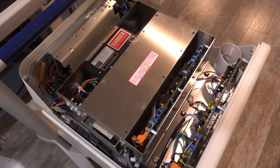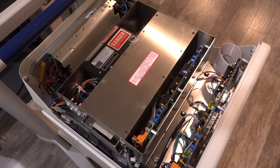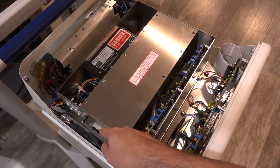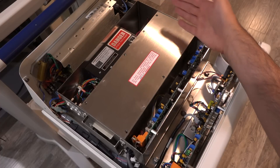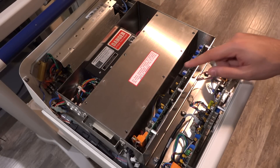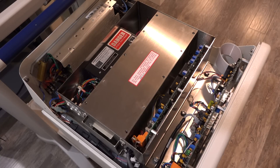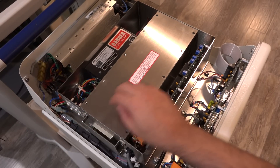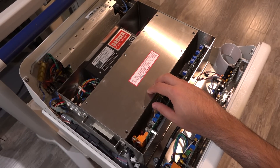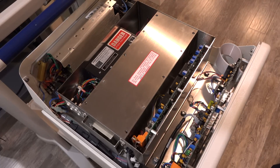These are security screws we'll need to remove. Generally I wouldn't run this without the top cover. There are holes in the top to access potentiometers without removing the panel — interesting. The fan has a metallic body with a piece of metal directly in front of it to prevent stray X-rays, plus a metal cover on top. Notably there are no interlock switches up here, only on the doors and sensor compartment — a bit unusual. There are also terminals to measure the kilovolt bias and milliamp current of the tube.